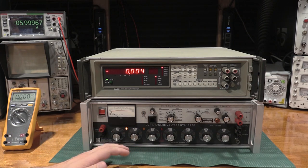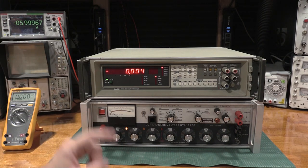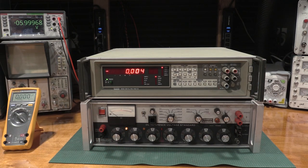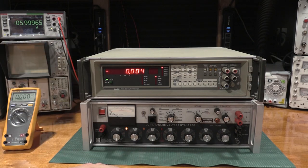The 7510 also requires a far longer warm-up time. To get to rated accuracy on a 6500 it's a 30-minute warm-up; to get to rated accuracy on a 7510 it's an hour and a half. The warm-up time is so important in the 7510 that there's actually a message on the meter that pops up to tell you when it's done. So you turn it on, walk away, get coffee, get prepped for whatever you need to measure, and you're good.